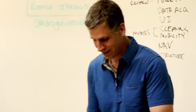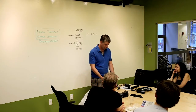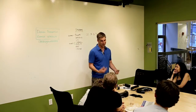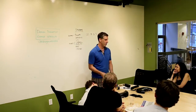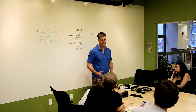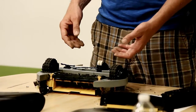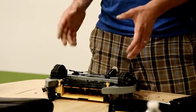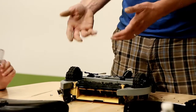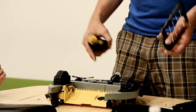When the cleaning head is at the wrong height, it doesn't clean - and you have a problem. We almost didn't have a way to clean the brushes in the initial design, but at the last minute we realized we should make them cleanable - which saved us. If we hadn't, we would have gotten 100% returns. Instead we had a really awkward UI requiring a screwdriver. On the newer design, the whole reason brushes come out easily is to avoid that problem.